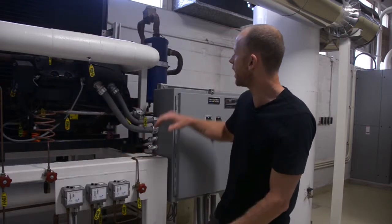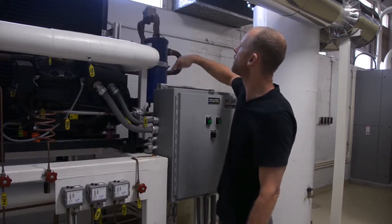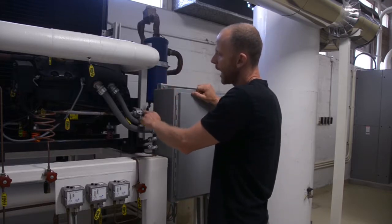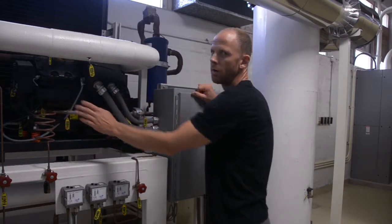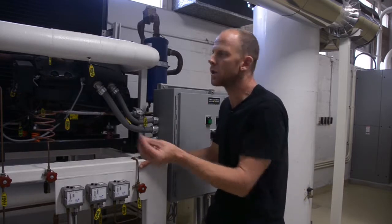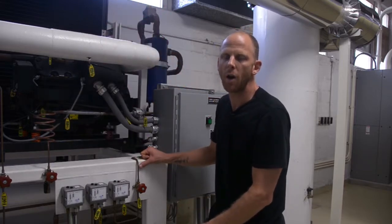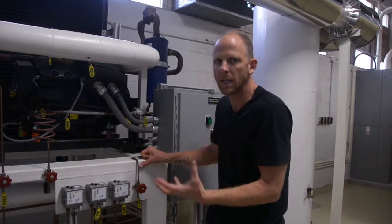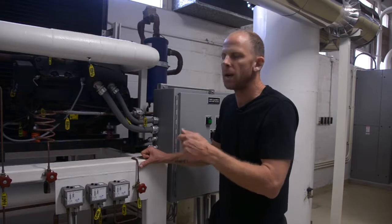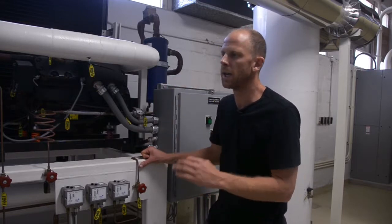Okay. We do have an oil separator here so that our discharge stream moves through this oil separator, and most of the oil should make its way back through this line and into the sump of the compressor here. But you do get tiny amounts of oil that will make its way into the Freon stream and might get trapped inside the condenser, and pump down mode is a good way of bringing that back. So if you're finding repeated trips on low oil pressure, pump down mode a couple of times may help to bring your oil level back and eliminate that trip.